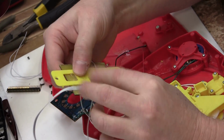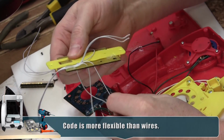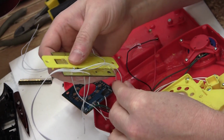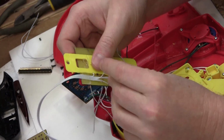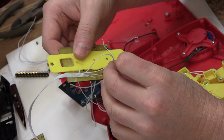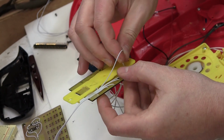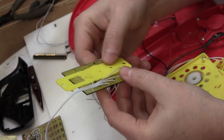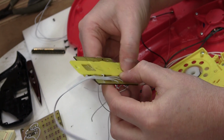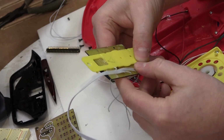So see how I go on the outside there, then this one will go here. Because there's less room on this part of the project than on other parts, so this one I wire efficiently, and then if the wires aren't necessarily in the perfect order, I've got more room to deal with that over here. So see, I'm just going right down the line, because if the wires don't overlap each other, then they stay flat. I even drilled a little hole in here and I dremeled a groove so that wire, see, can stay flush and flat and not much thicker than the yellow piece itself.